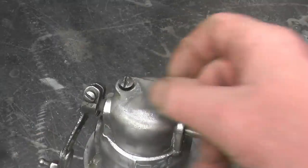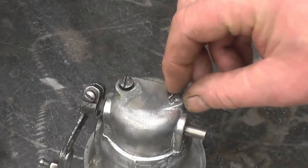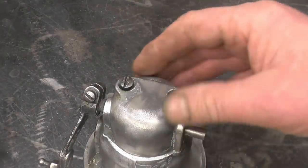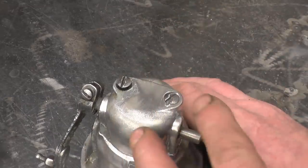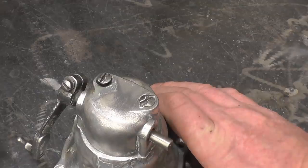The first thing is to try and get that screw out of there. What I'll probably do is put a 13mm nut on and weld through the nut and try and get a good hold of it. At least I can get a decent grip on it, and the heat going through there should help me release the threads.